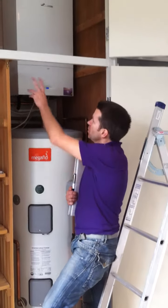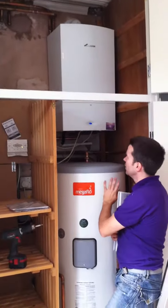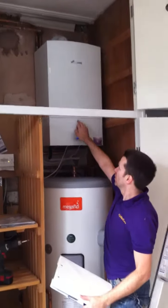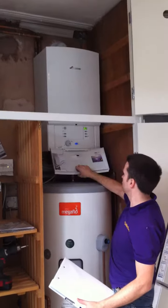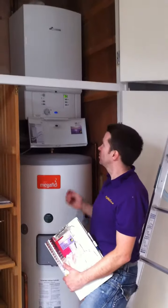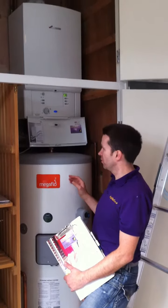So that was the old boiler. We've put a new boiler here and a new cylinder here. The system's been flushed and we've put a chemical inhibitor in the system. We've got a date on the boiler here which shows when it's been put in — keeps the system nice and clean and protects the life of the boiler.